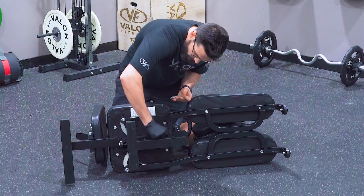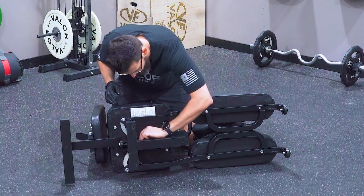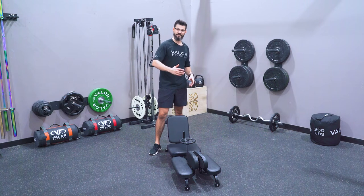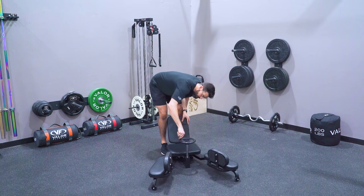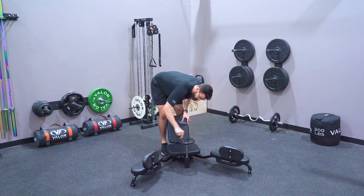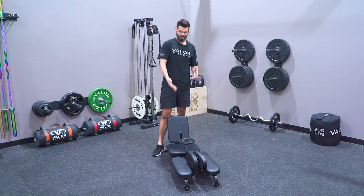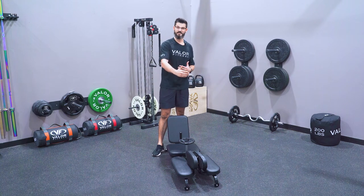What we're going to do is use the product to spread the grease manually through use of the product. Now that we have the drive shaft properly lubricated, we're going to rotate the wheel, let the legs widen, and run the gears up and down the drive shaft so that everything is lubricated. I like to stand on the back and rotate the wheel, then run it back. As you can see, except for the squeaking of the handle, the drive shaft moved really clean — it's because that drive shaft is now properly lubricated.